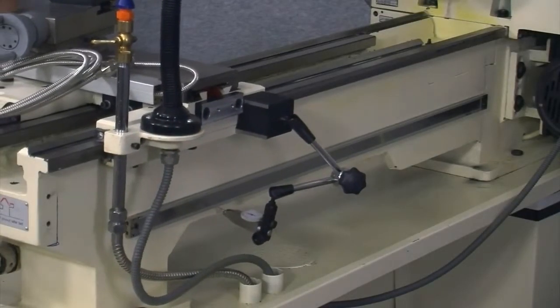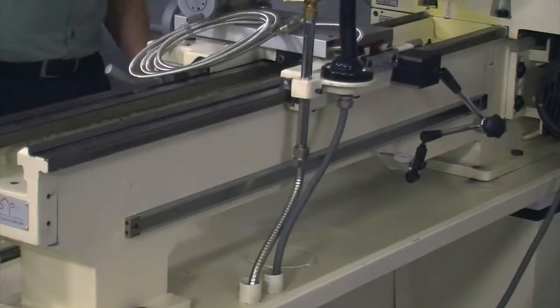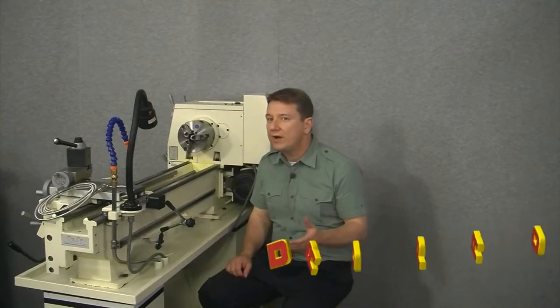That should do it. Let's move the carriage back and forth to double check. That looks a lot better — at both ends of the scale the deflection is right at zero. Officially, the deflection needs to be less than 0.1 millimeters for every meter traveled, and we want to get that as close to zero as possible. You'll need to keep going back and forth between adjusting the scale and rechecking your results. Inevitably you'll probably get some deflection, especially with longer scales — just remember, keep it within specs and you'll be fine.